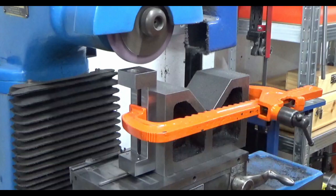This is our next setup. You can see we've got a big V-block on the table, giving lots of support for the part. We've got the part clamped to the V-block using a Carver clamp - if you've not seen that, I've done a video on me refurbishing this clamp and cleaning up the clamping faces so it can be used on finished machined parts without making any marks. These are very handy clamps and this is what I was using in my apprenticeship, which is why I really wanted one. A tip on safety: if you're going to use a big clamp like this to clamp a part up to something square, you need to make sure that whatever you're clamping to - in this case the big V-block - has got much more magnetic force going into it than the cantilever action of the clamp hanging out the far end. The last thing you want is for this to tip up into the wheel.